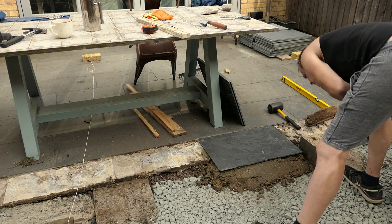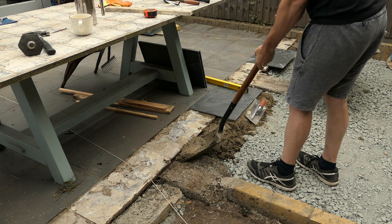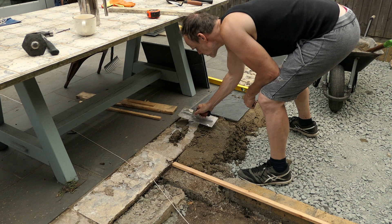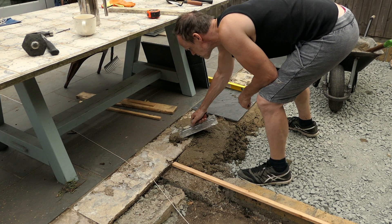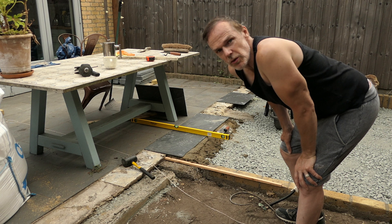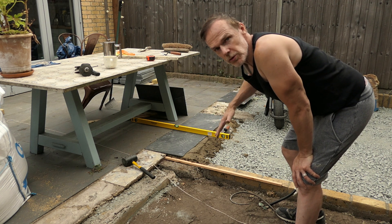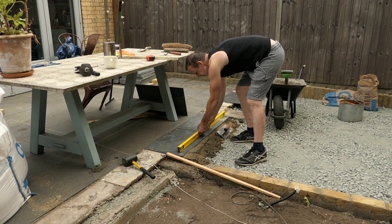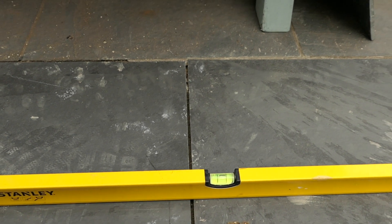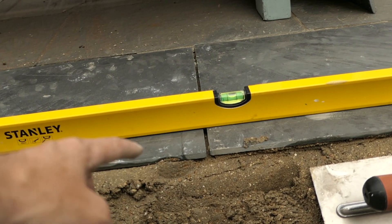For the next one I'm going to do exactly the same again — shoveling the mortar in place and then putting a small amount on the top section to be firmly set, then checking the level. That's two down. Make sure that it's all level, or actually you want it on a slight slant so that the water will drain off. I want it to be totally level across the width of my garden so the bubble of the spirit level is going to be exactly between the two lines. You can see there's a slight gap in the left tile under the spirit level as I'm using the spirit level also as a flat edge.